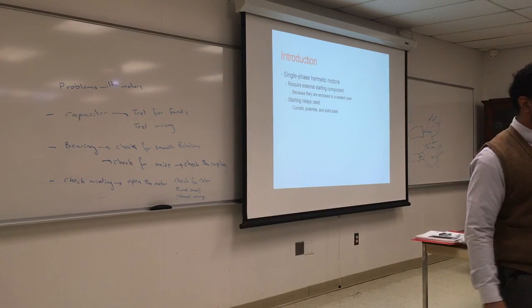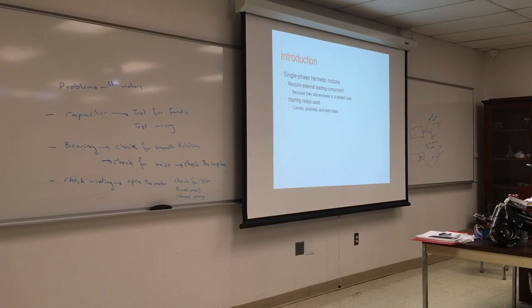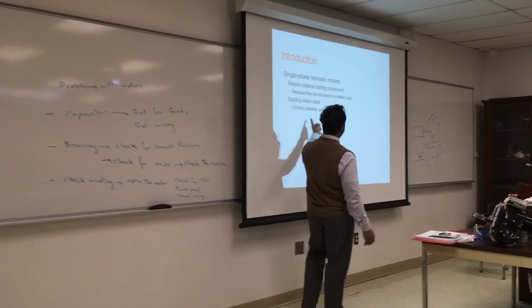So how would you think the current relay will shut off the circuit? What are the components of a relay? The magnet. Yeah, what is the magnet made of? Coils. So there's a coil in the relay. That coil makes a magnet. That magnet gets stronger if you draw more current through it. You agree? So that coil is designed to run a certain amount of current. If this current gets too strong, it will pull in a switch. Simple as that.